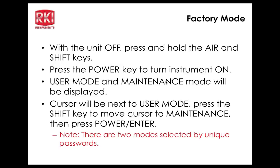Okay, I pressed the display button again and went from the protection to peak. Let's do it again here. There's protection, and it times out. If you don't press buttons soon enough, it'll time back out to the normal display, just like all the other units do. Okay, so there's peak, there's STEL, your cell readings for your H2S, CO and VOCs. Basically, toxic compounds will have a STEL and a TWA associated with them.